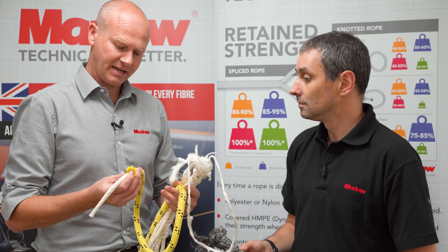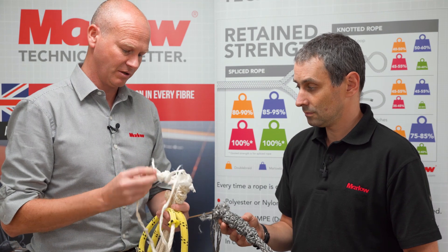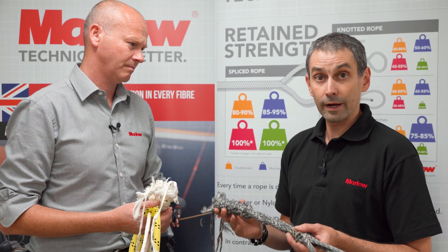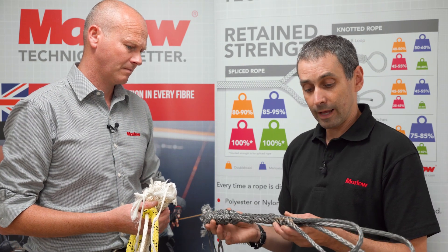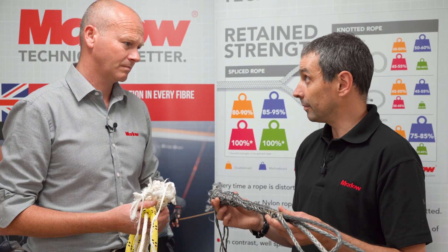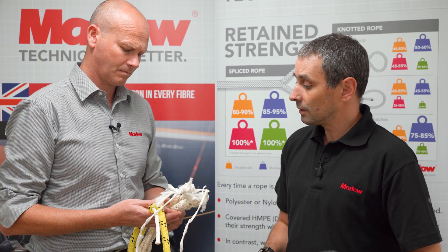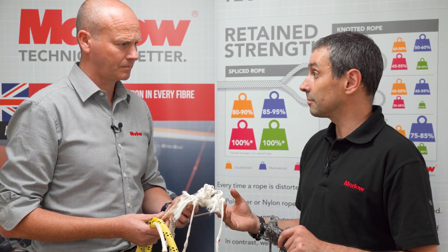So in summary, what we've done is taken the core out of the D2 Racing, built some strops, which Paul has tested to destruction. Paul, have you ended up with what you expected? Yes — the forestay strop broke at 9.8 tonnes, which is about 98% of its new strength, as you'd expect. It's been in an application under constant load, and that's good for Dyneema. This rope is in an application where the load comes on and off, so you'd expect it to lose more strength because of fatigue mechanisms. It's gone all the way around the world, 47,000 miles, and still has 80% of its original strength. That's a pretty good result — for most people, that's a lifetime of sailing.